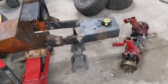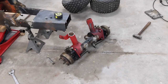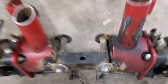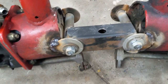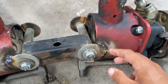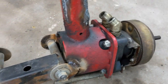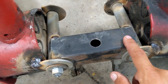This is part two on the 35 horse four-wheel drive Sears tractor. I got the front axle figured out - I already had it in there, pulled it back out so I can weld everything solid and put it back. The front axle assembly itself is only about six inches wide, so I welded some washers onto the roller motors, which are basically the front spindles if it were two-wheel drive. These red pieces are bolted to the motor as part of the hub which the tire bolts on.